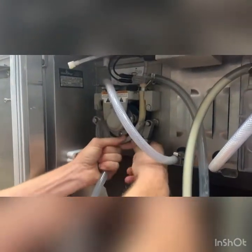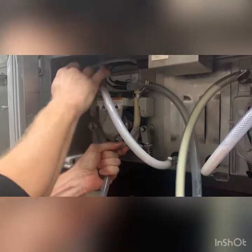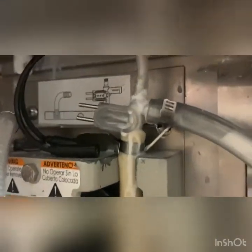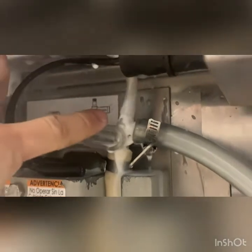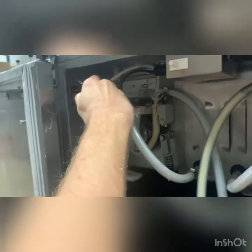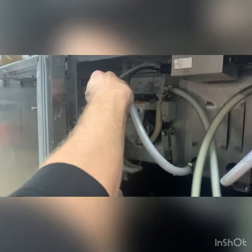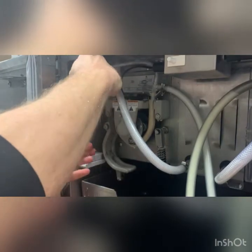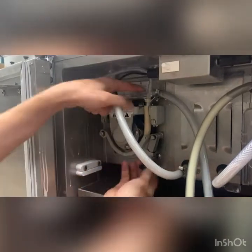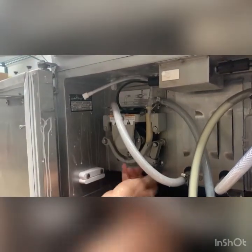When I push this up and unhook it, I want you to watch right here. You see that? You see all that spraying from right there? See — that's coming up from those little cracks. So this plastic unit is cracked and that's why it's sucking in air. I'm going to release this and let the pressure out. The barrel is just emptying backwards right now, but now you know you've got a leak — you've got a crack in this piece and we have to replace it.